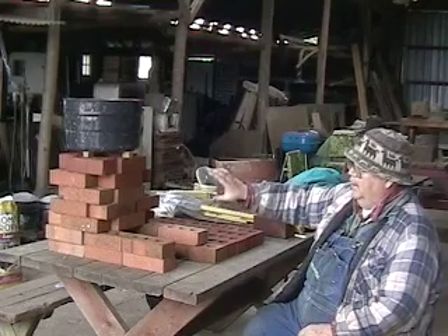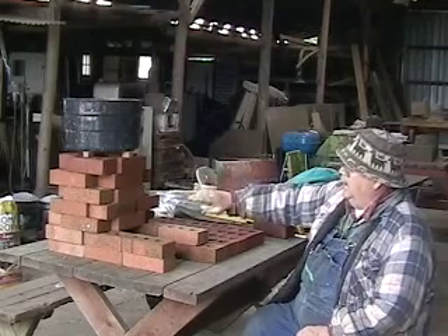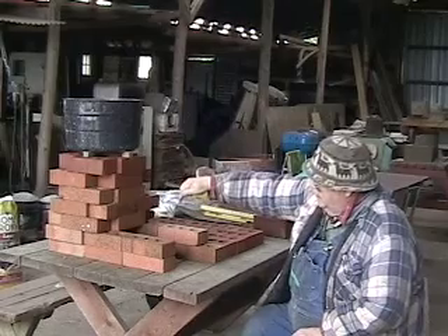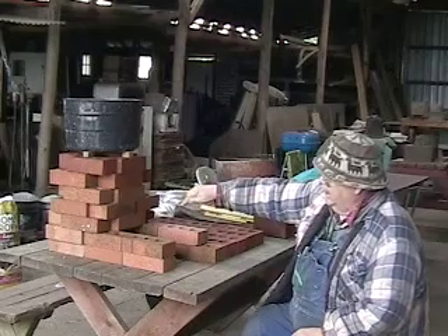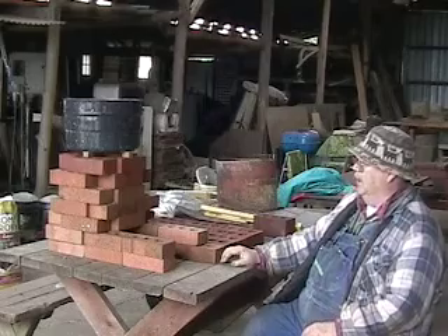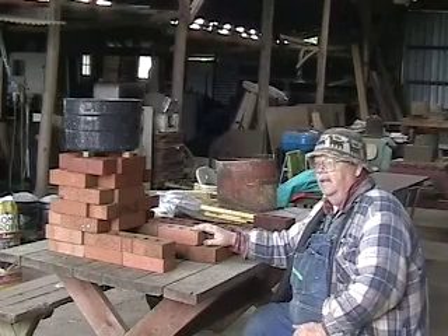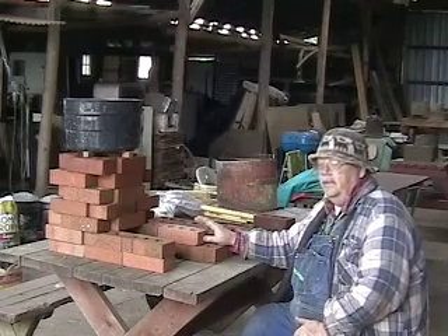What we want to do is put a cylinder of metal around these bricks and fill the space between the bricks and the cylinder — which in our case today will be corrugated metal wired together — with ashes to try to get a little more insulation. Ideally these bricks should be insulating, but we won't have them right away, and we need these stoves as soon as possible.